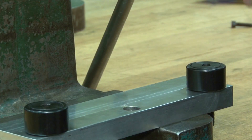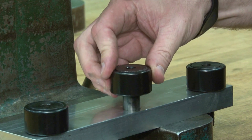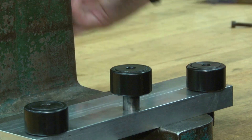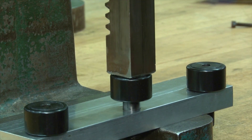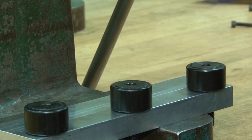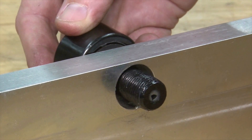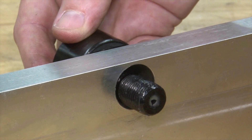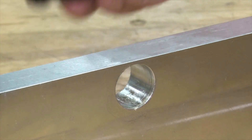Do you know about using a press fit? It can be used when installing stud type cam followers. Press fitting is when you have an interference fit, requiring you to apply pressure on the stud end face of the bearing — preferably using an arbor press. A loose housing fit can allow the stud to move within the housing during operation, creating wear and damage to the stud and reducing the bearing's operating life.